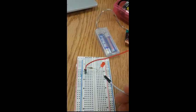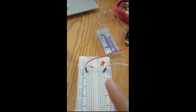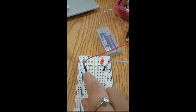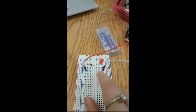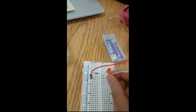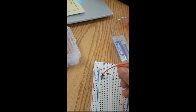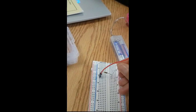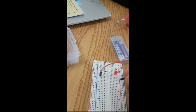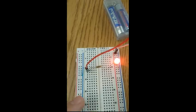If all of them are in the same row and we insert this, the light is not on — there's a short circuit going on. The current just passes through using the metal clips at the bottom, bypassing your LED. So the LED would only need to straddle between rows. Let's try it out — here we go.